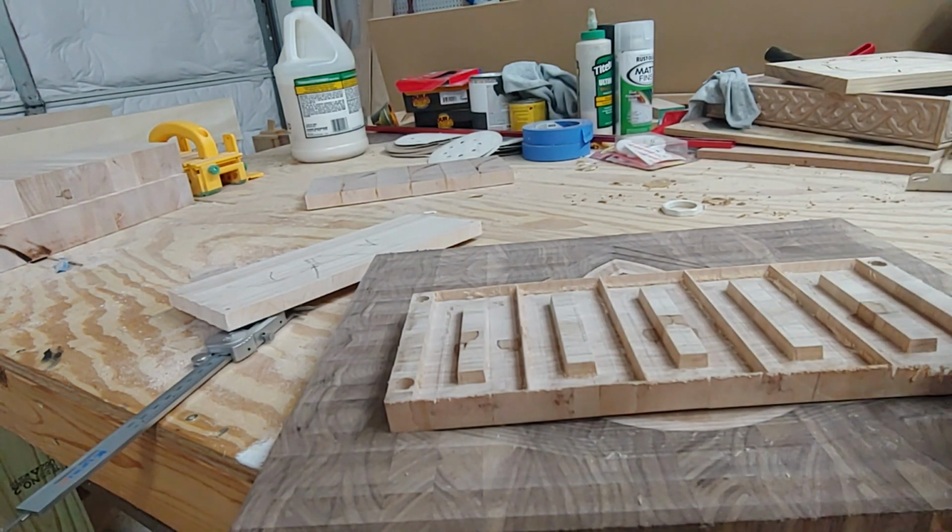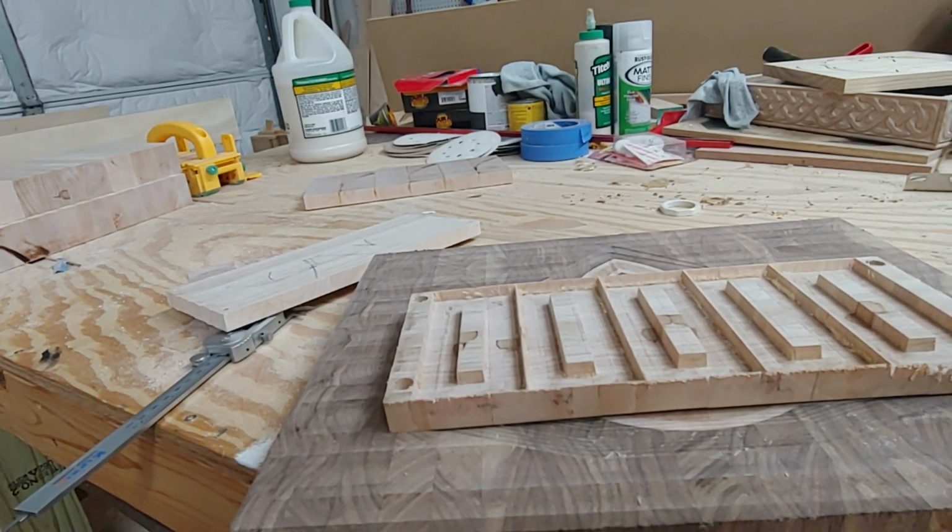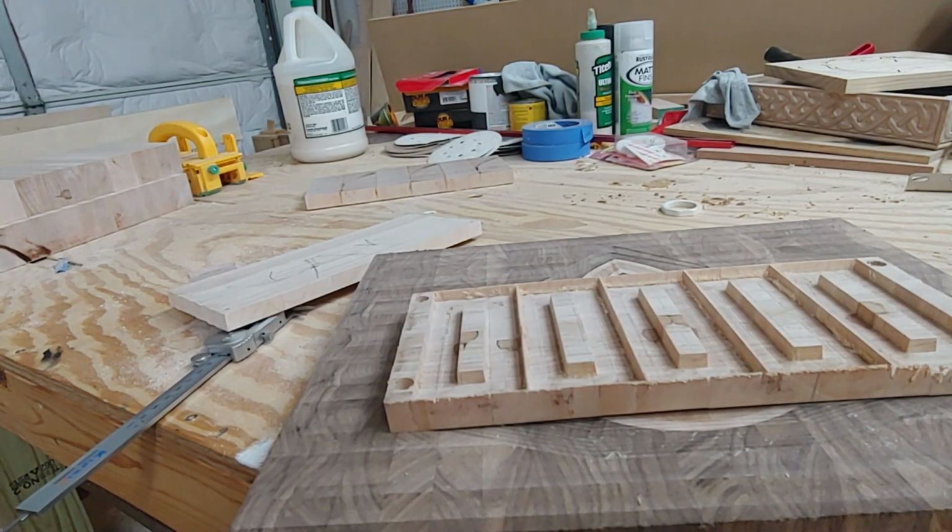So I want there to be a tiny gap left over, just enough to fill with wood glue, but not so big that there are air pockets in there that the wood glue isn't filling. And the current settings I was using was giving me an air pocket underneath my inlay. And that is a big problem when you're making a cutting board that's going to be hit repeatedly with metal objects. So let's get up to the computer and get started.